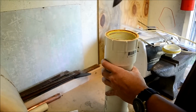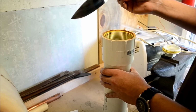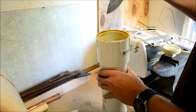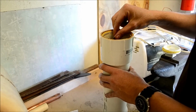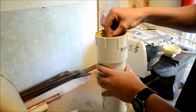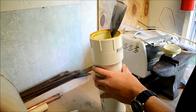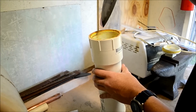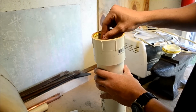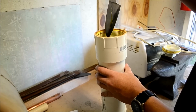So what I do, I clean the blade with the alcohol first, and then try not to touch it, at least where you're gonna etch it up in the blade part. So I just dip it in, swirl it around for a couple seconds, and you'll see it come out almost immediately. But usually I like to rinse it off, or just let it drain off and then dip it back in. Do that a couple times. So that's really all it is to etching, is just dip it in, come out.